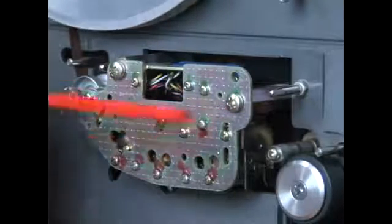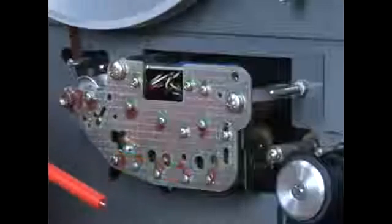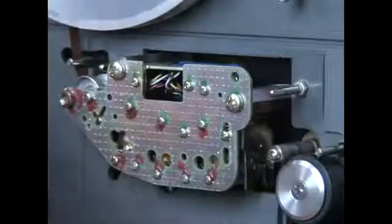There is one other way that you can do this, and that is you actually use an oscilloscope to set what they call the Lissajous curves. And I'll include a couple of pictures of a Lissajous curve as we go through this piece of the sessions. Anyway, that's how you actually do an alignment there for the record head.